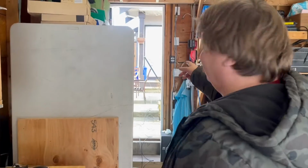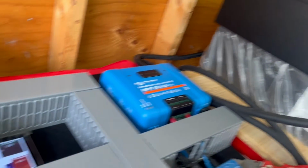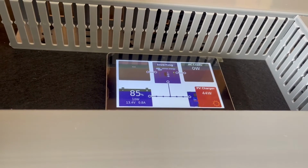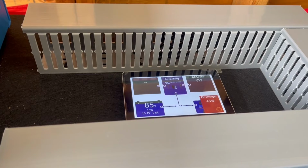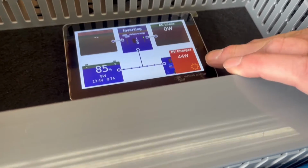And if you look at the panel over here, it's flipped upside down. So that's the back side of the panel giving you 47 watts. What these panels are really meant for, if you go with bifacial, is if you're in an RV situation, you gain another 5% of power. Or if you're in snowy climates, you get a lot of reflectance from snow. So if there is snow on the panels themselves, but nothing on the back side, as you can see right here, the back side is producing this power.